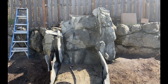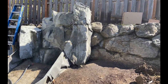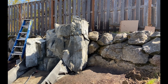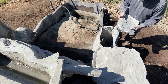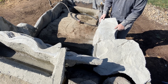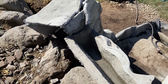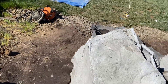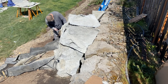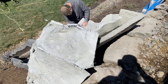In this video we have cut some panels and wired them together — what we call hanging the panels. We washed them down and we're about to add the fiber mud to seam them together. If anything is overhanging, we need to cut it off. Just more shots of Fred and I cutting panels and wiring them together, getting ready to mud them.